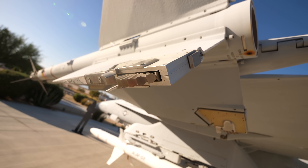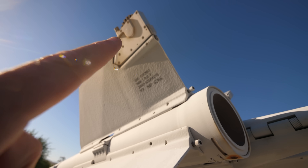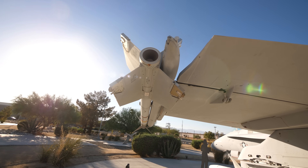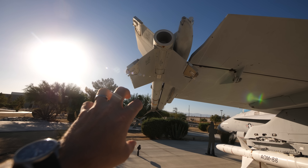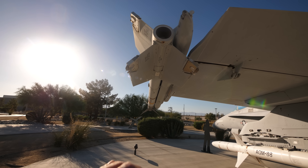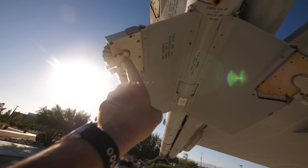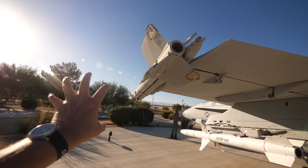You get a gyroscopic effect and it becomes a giant flywheel like a gyroscope. That angular momentum gives you an angular momentum vector right there. You can see there's four of them — one, two, three, and four. Imagine you're about to fire this missile. If you have problems with dynamic stability in the roll axis, because you're an engineer in the fifties and you don't have fast control loops and digital circuitry, this is just genius — it's a passive dynamic stability method. Imagine you could pin a vector here, here, here, and there, and just kind of lock it in space so it'll go straight. That's amazing.